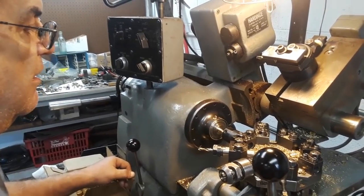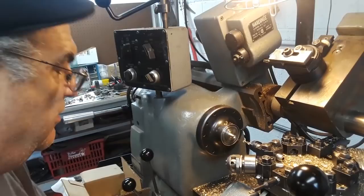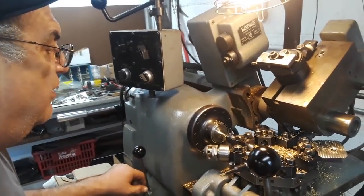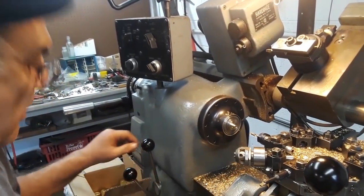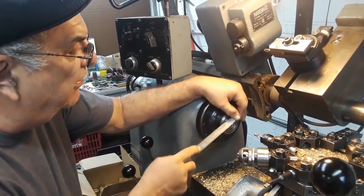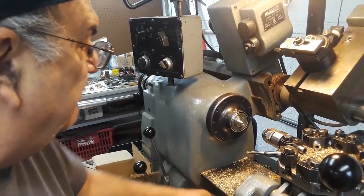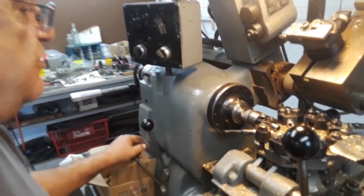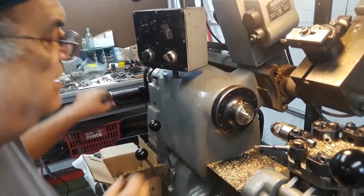Feed it up, drill. Turn the drill while it's still running fast, chamfer, take that little burr off of there. Number six — go in, it hits the stop, self-releasing tap holder, tap, that's it, done.